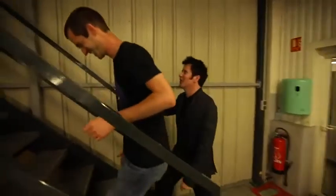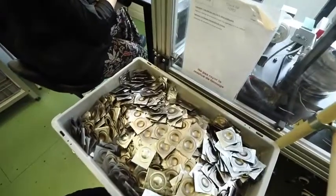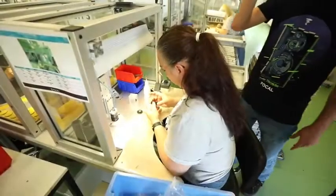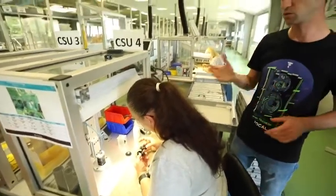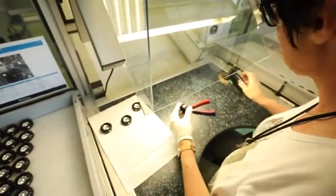Marvelous. Après-vous, off you go. So this is pure aluminium. And here we are doing thermoforming, as you can see. So it's going up to about 270 degrees Celsius. Okay, so here we are just literally gluing the surround, which is also the spider for the tweeter, onto the membrane. And then, once again, the soldering on the terminals.